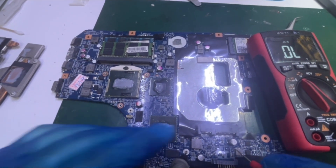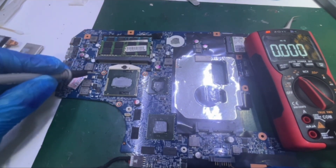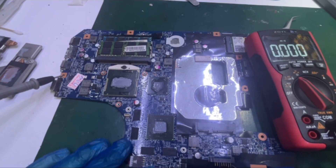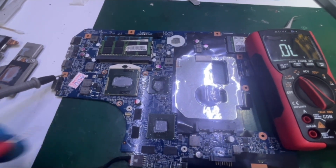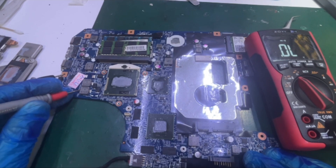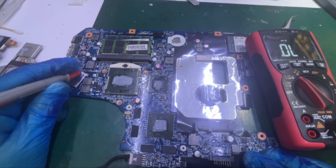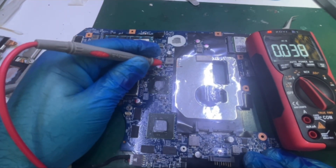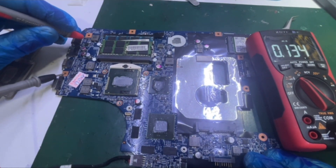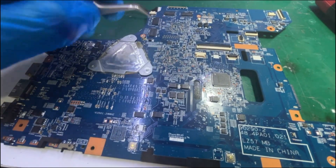In diode mode, and here we have a ground. This is ground. This one is for the GPU. What about the CPU one? Testing readings — all looking good. Time to swap between the two BIOS chips.